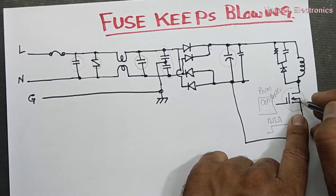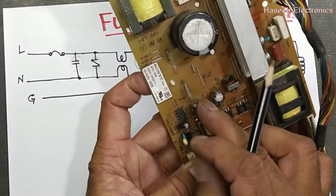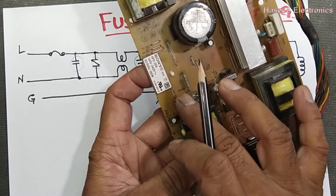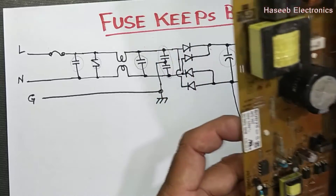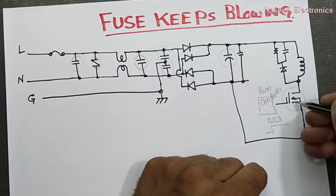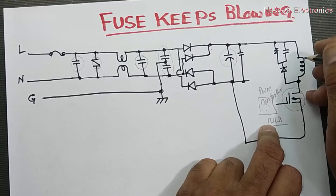This condition applies when we have an external MOSFET. But some ICs have an internal built-in MOSFET. With a built-in MOSFET, sometimes it does not show a source-to-drain short circuit when tested with a multimeter — the IC appears good. But when powered on, even though every component tests good, the IC internally will not switch — it will just permanently turn on the gate. So maximum current flows through the primary winding, which is just a piece of wire. If the magnetic field does not change, current flows directly and burns the fuse.